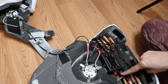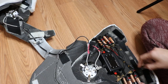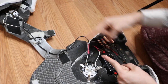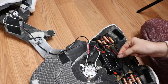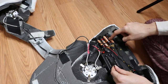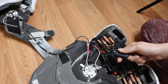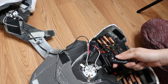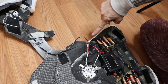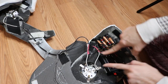From the dimmer switch, we connect the two battery packs. One wire from the dimmer switch goes to this battery pack, and that battery pack is also connected to the other battery pack, so we get the same voltage going to the dimmer switch and the lights. The other wire from the dimmer switch goes to the on-off switch, and the other battery pack is also attached to the on-off switch. So this on-off switch shuts off the battery packs as well as the dimmer. If I try the dimmer with the main switch off, we get no light — this saves battery power. When I switch the main switch on, we get power to the battery packs, which powers the dimmer, which then powers both the lights.